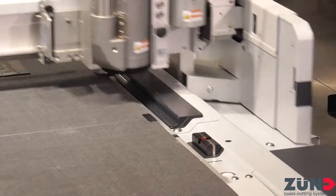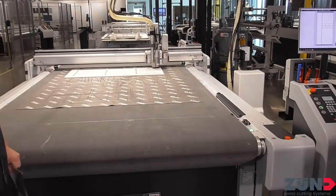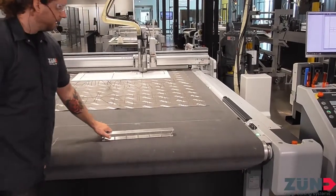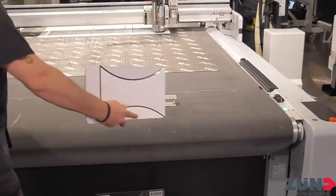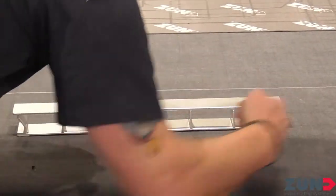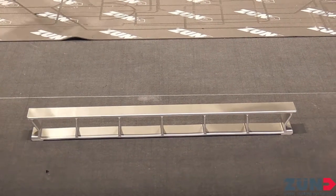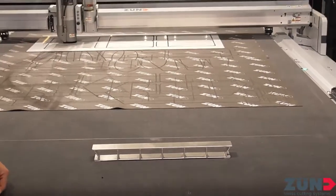I love that touchless ITI — you don't have to wreck your bits or blades just to get them initialized. We don't have to initialize again or read the border again because we already did that — it just picks up right where it left off. With the table play feature we can zone down this machine, especially with tandem mode — I can shut off the whole right side, keep it open in the middle, then shut off the left and the whole back side, and it reads that automatically and changes where the zones open and close when you register your material.